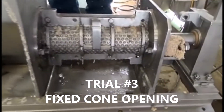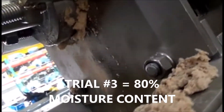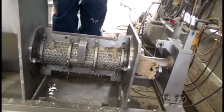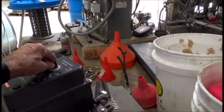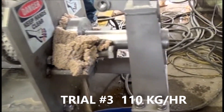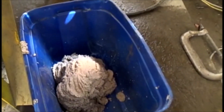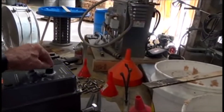We're running a time test. Not much pressure coming out. I slowed down the press — channeling out of the other side. Channeling is unavoidable pretty much with this. I guess if I slowed down the RPM even more, but I want to see what that looks like. And now I'll adjust the speed again back to 120 hertz. See if we can see a difference. I'm channeling out a lot more material, obviously, and getting somewhat more water out. Looking at how soupy the cake coming in is — I'm trying to pre-thicken the cake. Set my speed way back down here and see what that looks like.